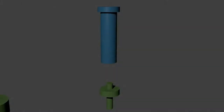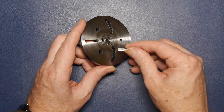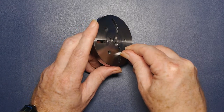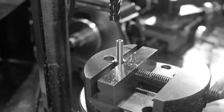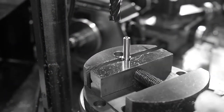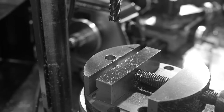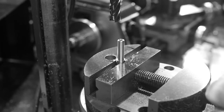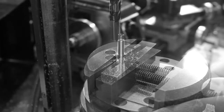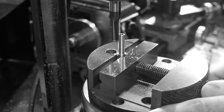The procedure I used to try and make the two shafts was intended to solve two significant problems. Firstly, I needed a way to cut the curved faces to allow the central shaft to fit snugly into the curved slot of the faceplate. In order to do this, I needed to be able to hold the part in the vise in such a way as the part could be rotated around a centre with the correct diameter while it was being cut. The largest diameter of the part was at the opposite end and prevented the vise from being able to hold the part close to the end being machined, so I had to include extra stock length at the full diameter to grip in the vise. I encountered quite a lot of flexing with this approach and the resulting faces were not very parallel.